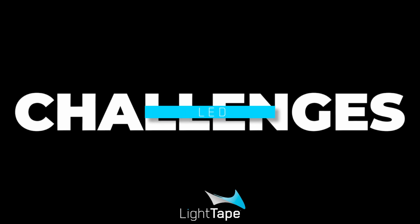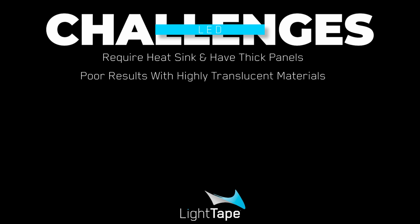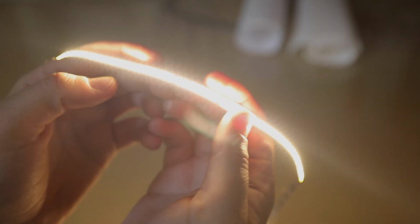LEDs take longer to install since they require heat sinks and have thicker panels. This does not work well with very translucent stones and surfaces because you see the seams where the panels end and where the LED bulbs are. Don't be fooled by the LEDs in the stone showroom that are 2 feet behind the slab. Remember that these harsh lights are going to be right behind your stone.